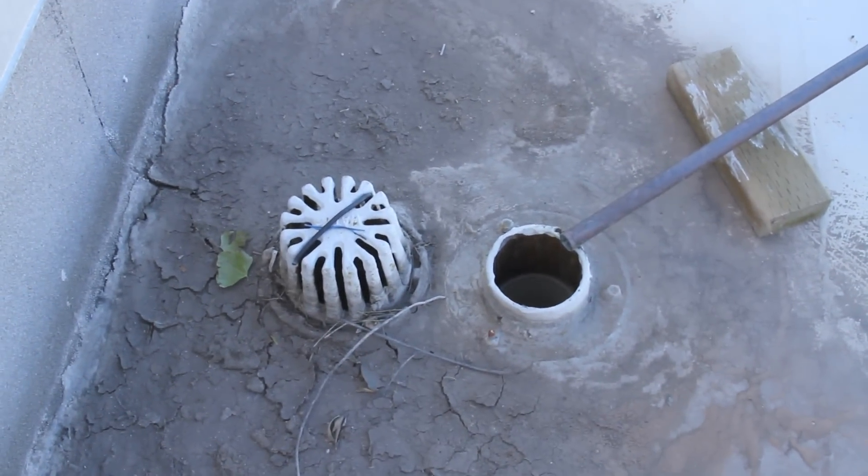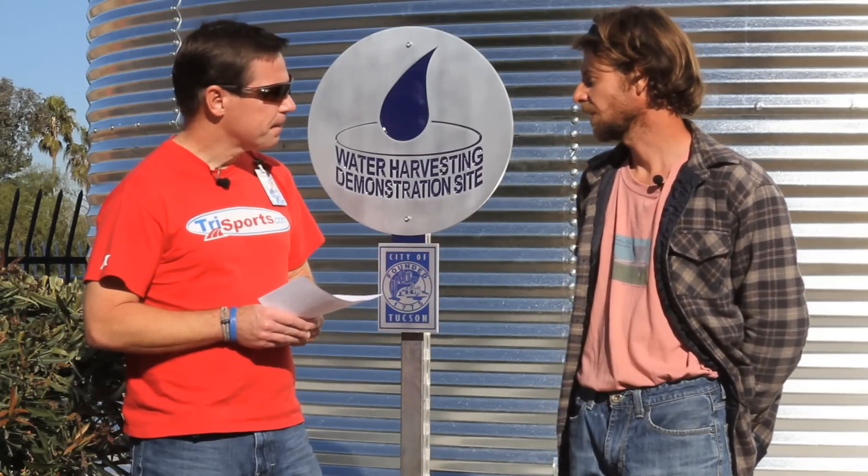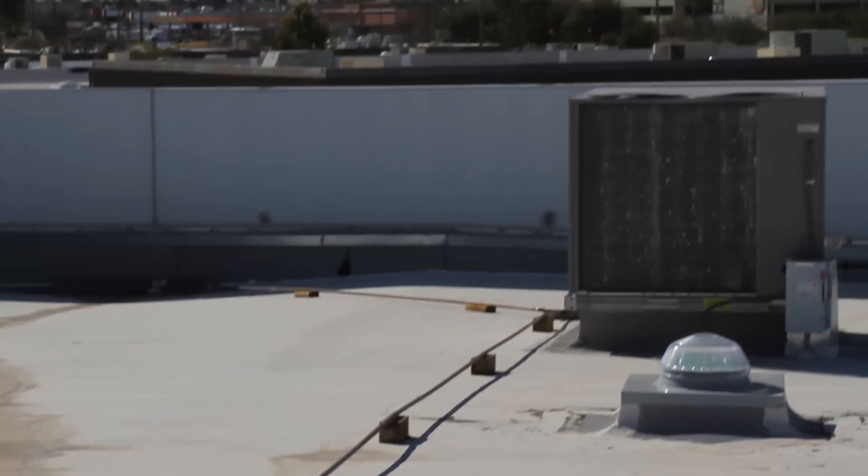Yes. Tell us a little bit about how that works. Evaporative coolers utilize a temperature drop by evaporating water. There are no air compressors that need to be run, so they're very energy efficient, but they tend to build up high minerals, so water needs to be flushed out in order to maintain that system. That flushing water is also captured in the tanks.